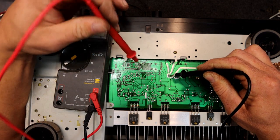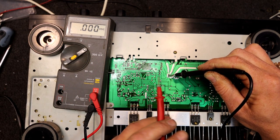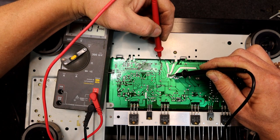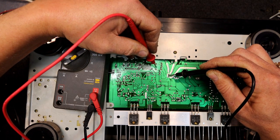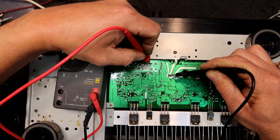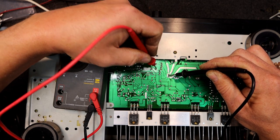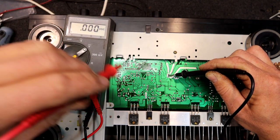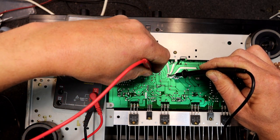The relay has two terminals further away from the coil side. It's a bit hard to follow if you're not familiar, but the relay has six terminals: four pins are the speaker connector, two pins are the contacts on the speaker side, two more on the amp side — normally open, and when power is applied they connect. There it goes — it actually just clicked in! It took that long. I just heard the relay click. So maybe it had DC to start with.